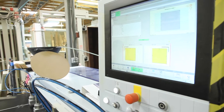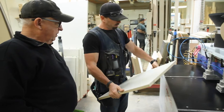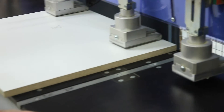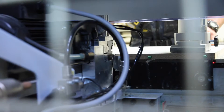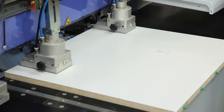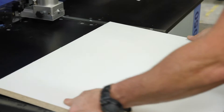After the pieces are edge banded, Patrick then moves over to the drilling and pinning machine. Different programs are used for this machine depending on what the part is, the overall size of the finished cabinet, and any other special considerations. After being programmed for the project at hand, the machine makes really quick work of both drilling precise dowel holes and inserting the pre-glued dowels into the parts. The glue on these dowels is activated with a small amount of water. Spiffy, huh?